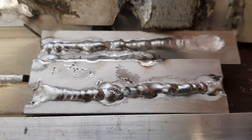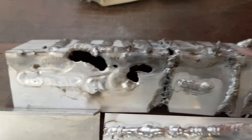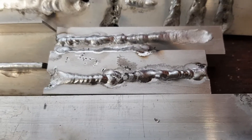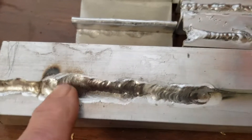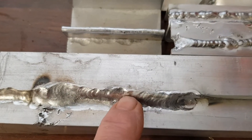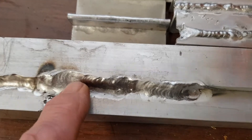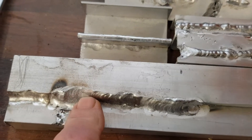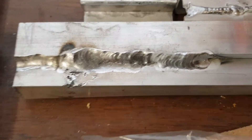I mean, I'm no good at welding — I'm only just starting, so please forgive this lot. This is the sort of things I've been doing. That was my first day Ali welding. And my second day I got a bit better — it was getting too hot. I should have stopped and then started again. You can see here it got too hot, welded from there, got along there, got too hot, it starts to sink. Should have stopped there, let some gas purge out, then waited to cool and started again. But I didn't.